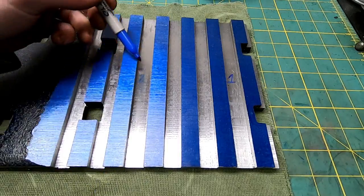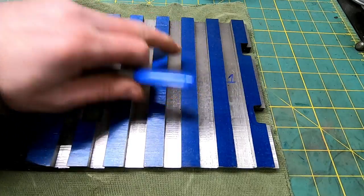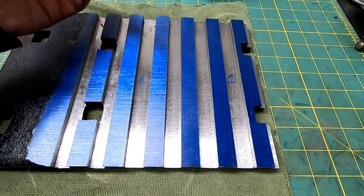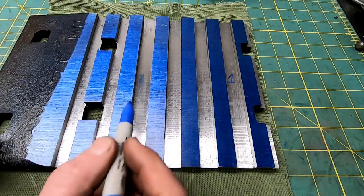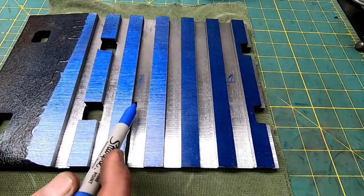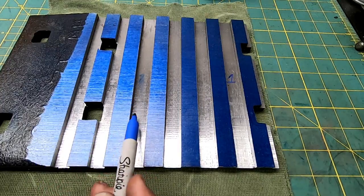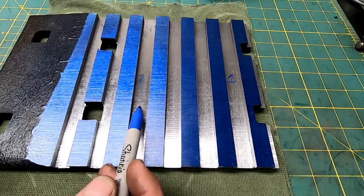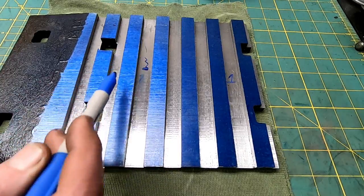I'm still grasping at straws on clamping, clamps to hold on to that table. I don't have a really good clamp set for that mill yet. But it looks a lot better, especially up here, the first three-quarters of the cut. I had to stop, change camera angle, move a clamp, all that stuff. So I had to mess with it, and we got a little chatter in here. But it definitely looks a lot better all up in here.